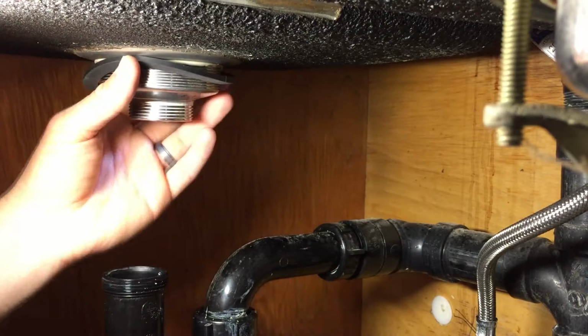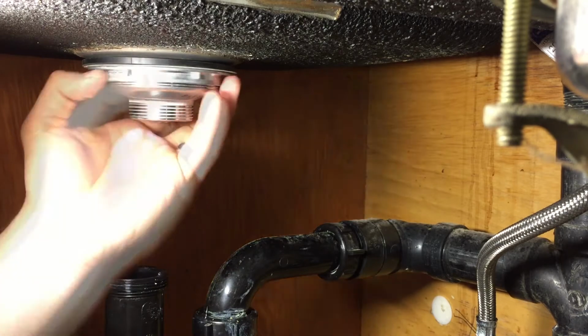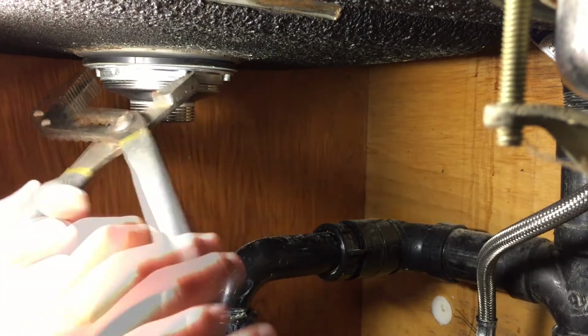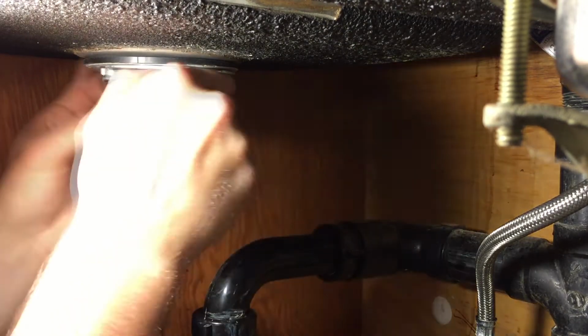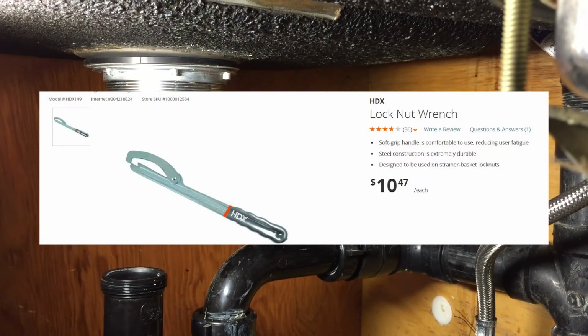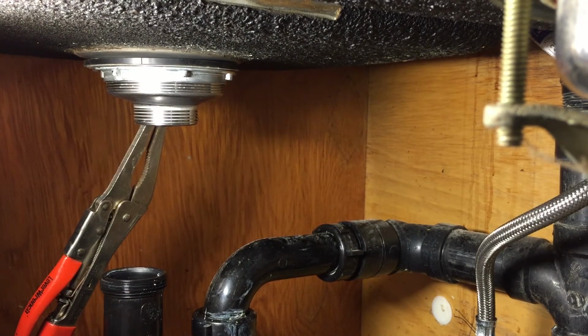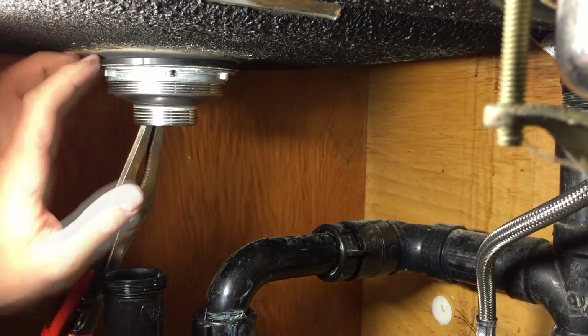To affix the strainer basket permanently, on the underside we will push up the rubber washer, the cardboard friction ring to prevent binding during the tightening process, and the lock nut. I highly recommend you purchase a lock nut wrench for this piece. It can be done with channel lock pliers as I used, but isn't ideal. I will link a lock nut wrench in the description.